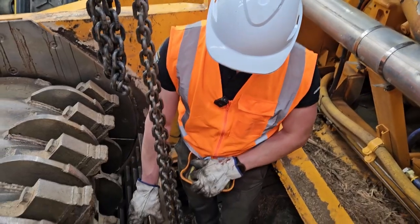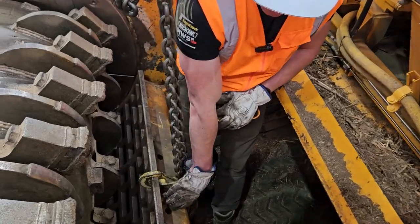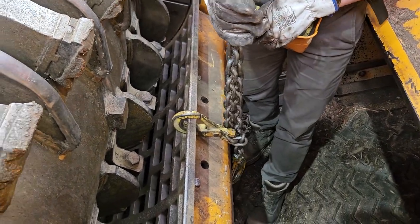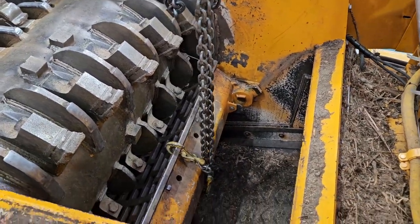With your hook in place at the top section of the grate, make sure the hook is secured above the grate frame so it doesn't collect the grate frame on the way out. Remove yourself out of harm's way and haul the thing up.